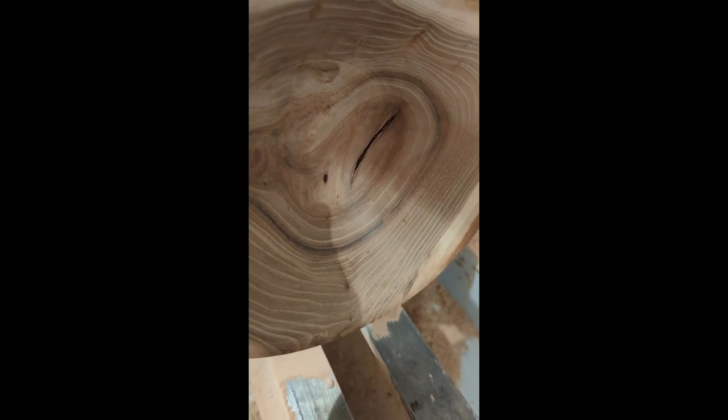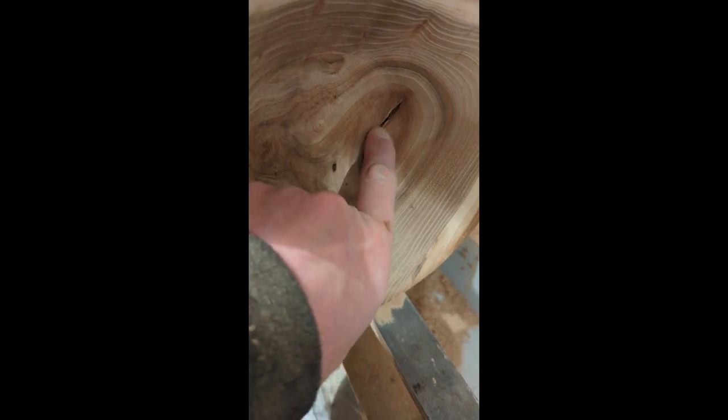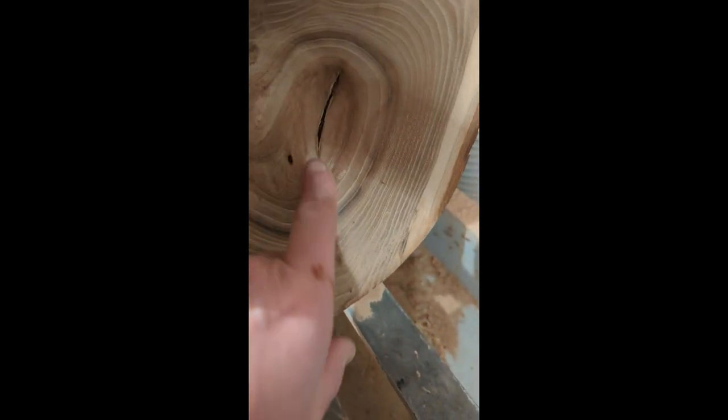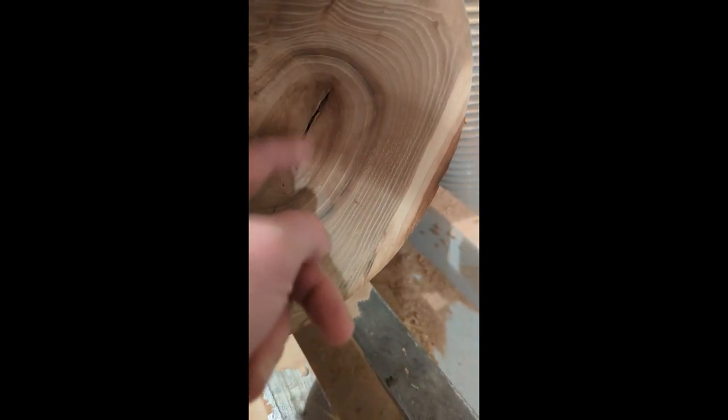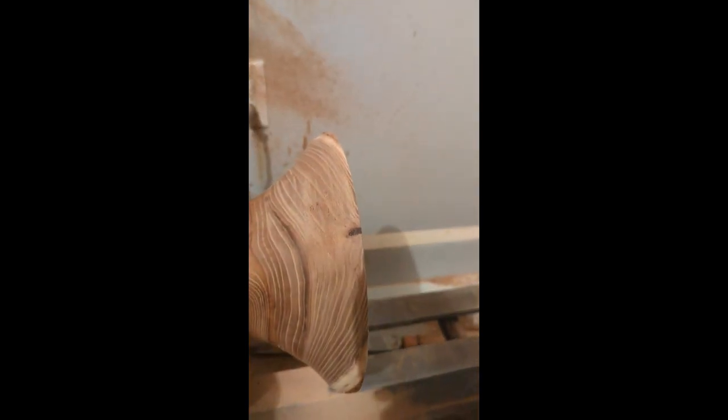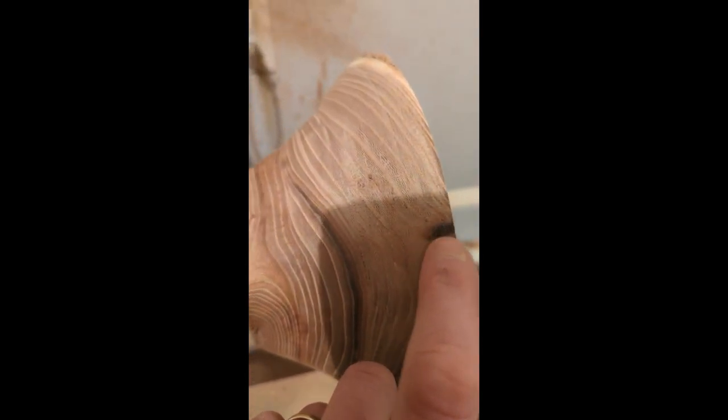The inside of the bowl has been sanded to 60 grit to smooth out any tool marks — it's pretty smooth — but you can see another crack here. I've seen it all along; it doesn't go all the way through so I wasn't concerned about structural integrity, but it still needs to be filled because it's deep and wide. I'm going to use the coffee and super glue again to fill it. There's already discoloration around it and the crack is dark in color, so I think filling it will blend in quite nicely.